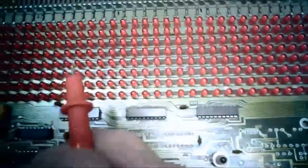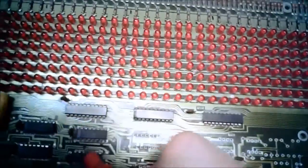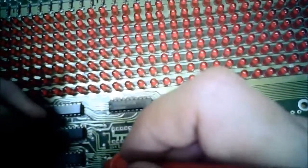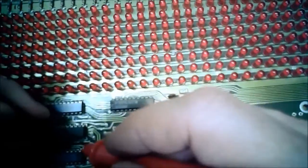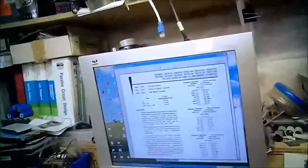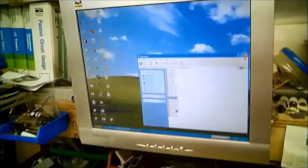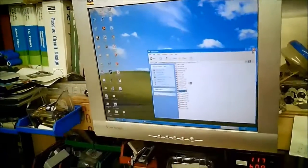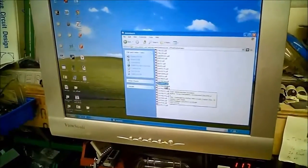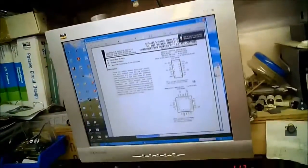1, 2, 3, and 4 right there. Now I marked this pin. That meant he went someplace, and I already debugged who the hell he was. But I'm not sure what he was. Let's pull up the 125 logics and see what he's about. Now, the 125s on this card are being used as input gates. So basically there's some external I/O that's trying to get onto the bus to the processor. And this is the guy letting it do it.